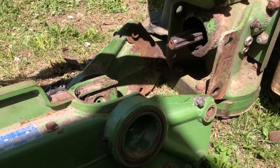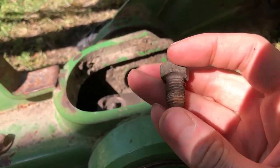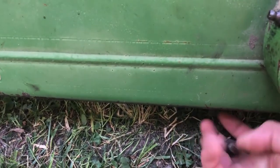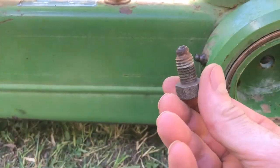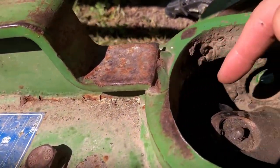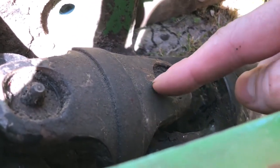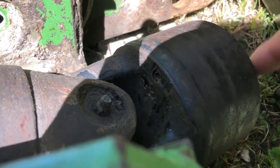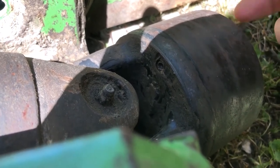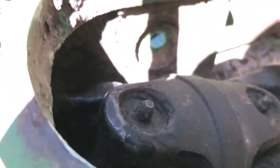I had to take it all apart. Inside there's a bolt that mounts — there's a hole underneath that goes into that shaft and holds the U-joint intact to the shaft. I took the bolt off from that hole but the shaft still wasn't coming out. I don't think I need to remove that right now — those U-joints are fine. The problem is with this one here. The grease nipple is gone, so I bet there's no grease in here. I need to repack it with grease and take it apart from here.